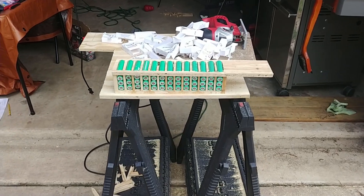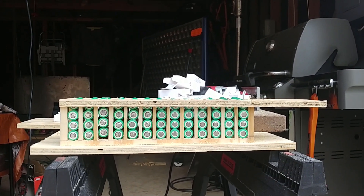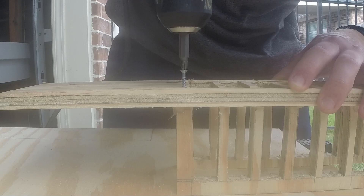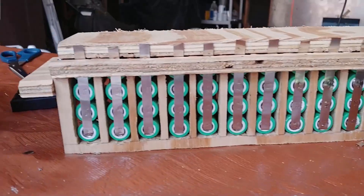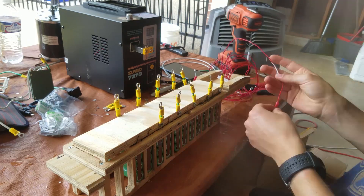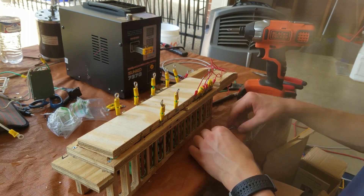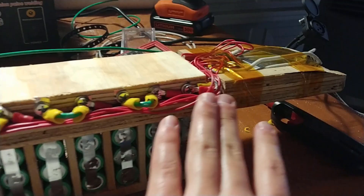Here is the battery pack. What I'm going to do is hot glue this in place, then drill pilot holes and fasten it up. I think it's a pretty good time to start spot welding up the battery pack. The spot welding is finished. I cut my wire into multiple segments and crimped ring terminals to either side. I also crimped some lower gauge ring terminals to the BMS leads. I used number eight screws to fasten the ring terminals to the nickel strips and into the plank of wood behind it. After I had fastened all the batteries correctly, I decided to test it out.